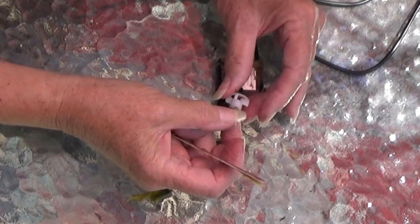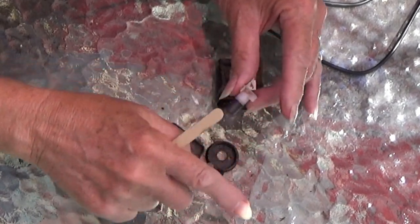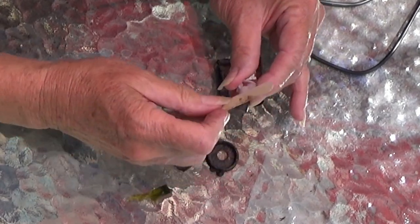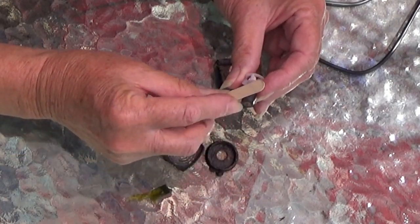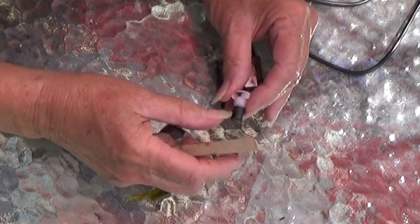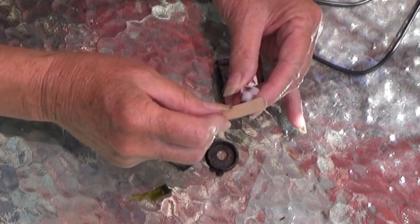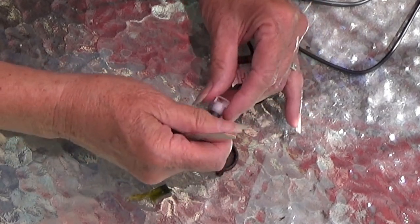You can clean this off with a paper napkin, and if it still is not working, I've taken an emery board and scraped it — sandpaper, whatever you've got. Clean it off really good, because if it gets hard water on here it won't work, it'll just stop working. This is like the simplest machine motor you can find. I really have not had any of them break — I thought they were broken, but after cleaning it off they work fine.